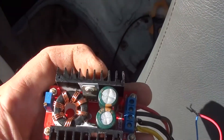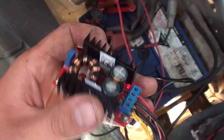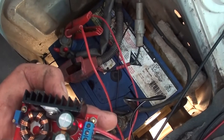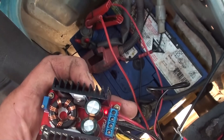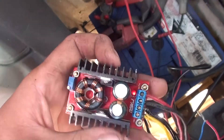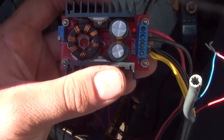Alright — and that was a bit of a stupid move on my behalf, turning the key to try and start it with the boost converter connected. It's cooked the boost converter — the red light comes on but nothing comes out the other side. We'll see if we can work out what's going wrong with that in another video. Unfortunately it was actually charging quite well, so it would certainly work, but you definitely need some kind of protection on the circuits. I figured the Xbox's controller would have good enough protection, but obviously not. We'll try something else — thanks for watching. Lesson learned: that's how you kill a little boost converter. Catch us on the next one.